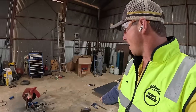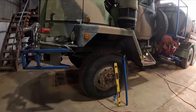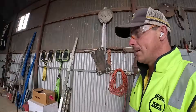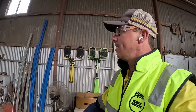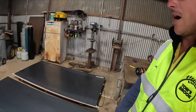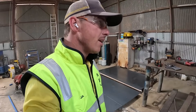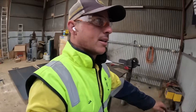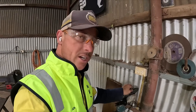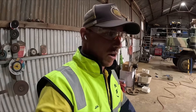Now to cut something I don't really want to do — it's an absolute pain trying to cut a nice straight line that long with an angle grinder. Ideally I'd use the little four-inch grinder but it'll cut through the discs in a matter of seconds, so I've got to use the big nine-inch and hopefully get it nice and smooth the whole way along.